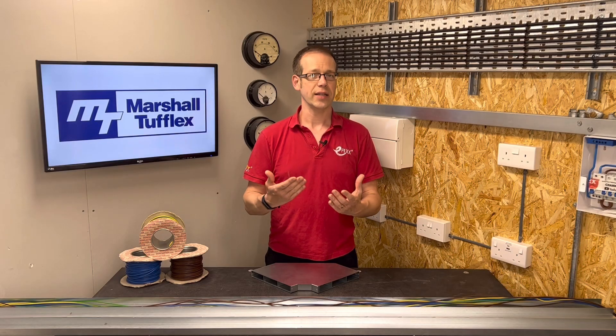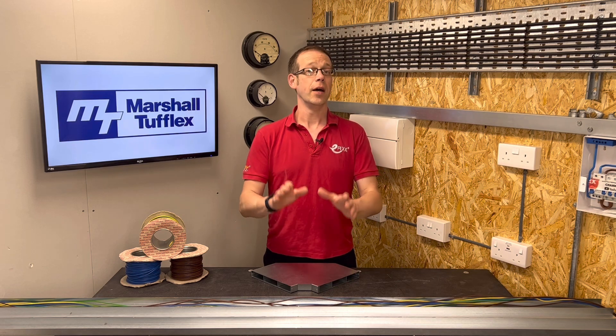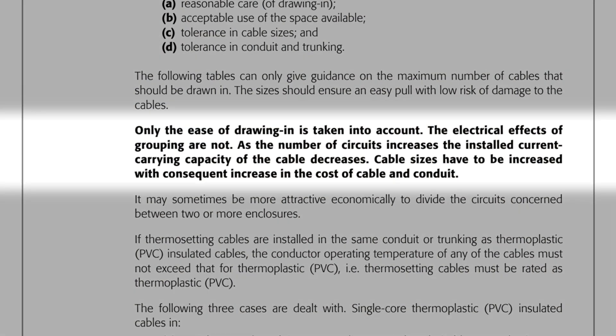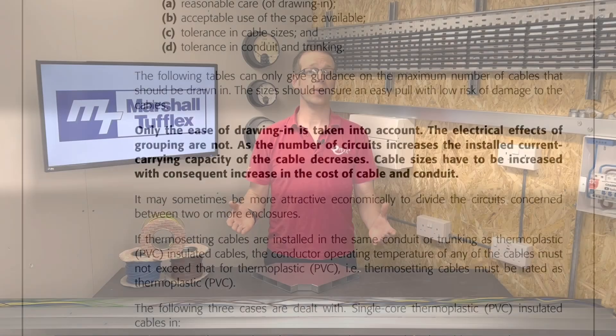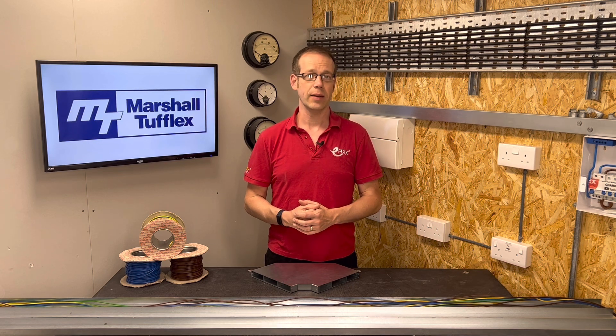A gentle reminder there that this is just a guide, and that the variables mentioned could impact on the number of cables you can install. Then a bold print reminder: only the ease of drawing in is taken into account — the electrical effects of grouping are not. As the number of circuits increases, the installed current carrying capacity of the cable decreases. Cable sizes have to be increased with consequent increase in the cost of cable and conduit. The guidance we're about to consider only takes into account the physical space the conductors take up, not the heating effect of grouping cables and whether they will remain compliant. To work that out, we'll need a future CPD.